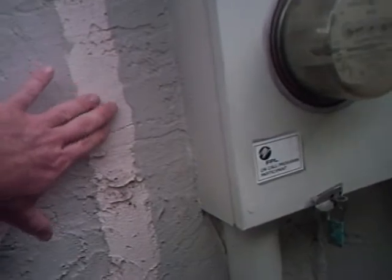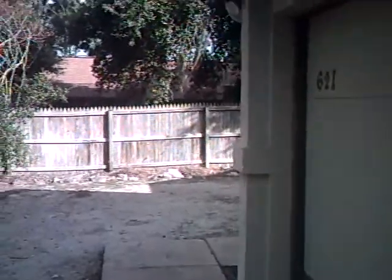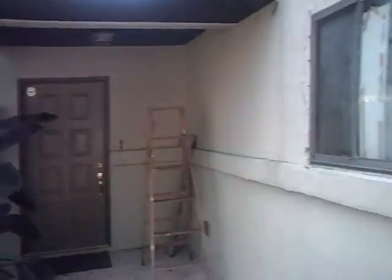Here's where you can see the original stucco. It's kind of chalky. I had a downspout there, but it's been fantastic. It's still not chalky after, I'd say, 14-15 years now. It's faded a little, but the color I chose, you really can't see it. So I just can't say enough about that. Elastomeric paint for any kind of stucco surface to just waterproof it.